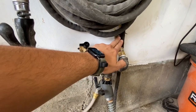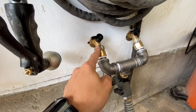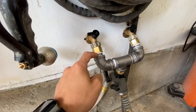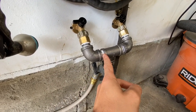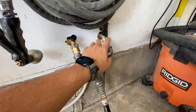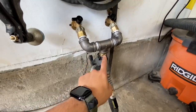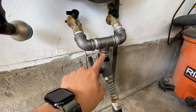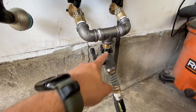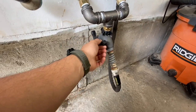Hot, cold — it's the mixing valve I built here. These are female hose thread to female iron thread to a three-quarter inch fitting, three-quarter inch elbow, three-quarter inch close fitting, three-quarter inch T, doubled on this side. Wasn't able to put the hot water in until I saw how big the tool was, marked the wall, drilled the hole, ran the pipe. It comes down here to a three-quarter inch male iron pipe to three-quarter inch male hose thread.